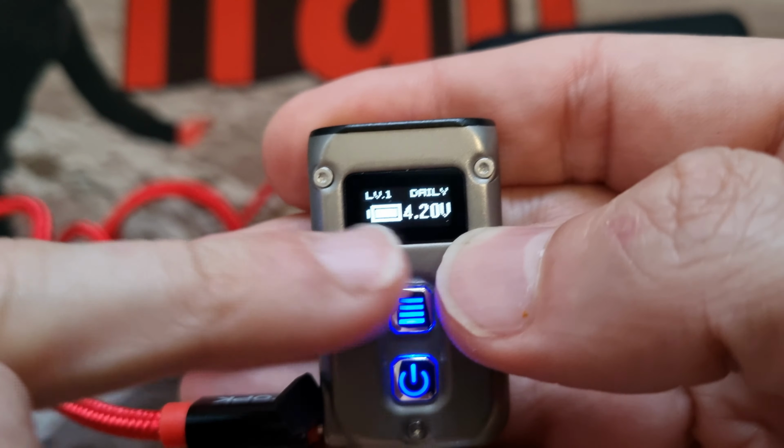In regards to flicker, I didn't notice anything. There was some slight modulation coming in there, I noticed on my testing, which is weird because they're claiming that this is a constant current circuit, I think. In other words, there is no pulse width modulation. I didn't see any in my testing, no matter what mode I put in or what conditions I was in, when I was near running water, it didn't matter. I didn't see any flickering, which is great, because I'm not a fan of that.